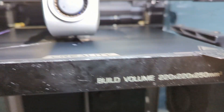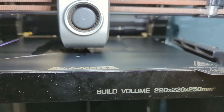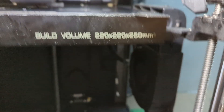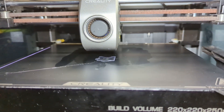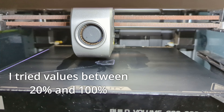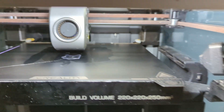As far as cooling and fans go, I did not run the fans during the first layer — I found that to be the best way to lay that first layer down. I do, however, run the fans for the rest of the time. It's recommended by the filament manufacturer, and honestly in my trials I didn't really find any difference whether the fans were on or off. It just makes me more comfortable to hear the fans running. Don't judge me.